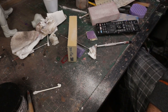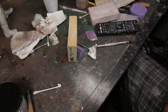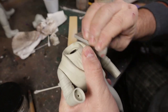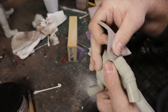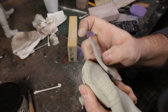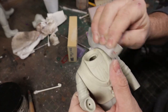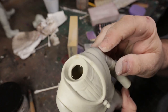And then I'm going to go down to... I really need to order some more sanding sponges. The super fine are my favorite. The 3M super fine sanding sponges are my favorite. They last really long. They're right about 500 grit. They say 400 to 600 grit, but I'd say they're about 400 grit. And as you use them, they get less effective, so then you can use them to do finer sanding.